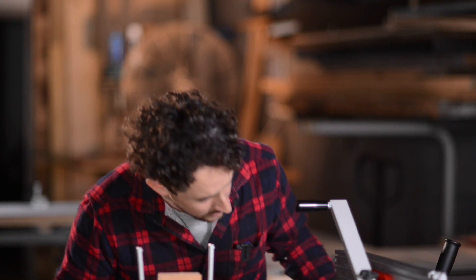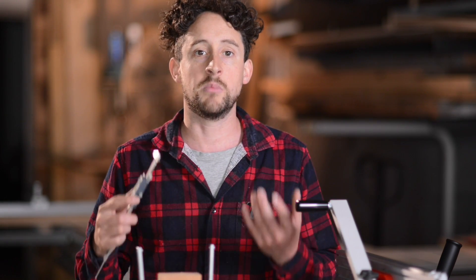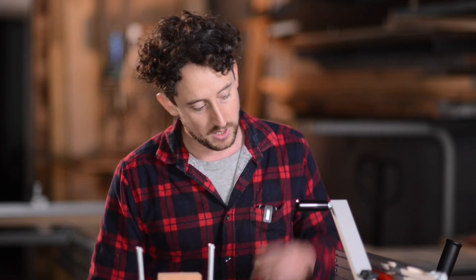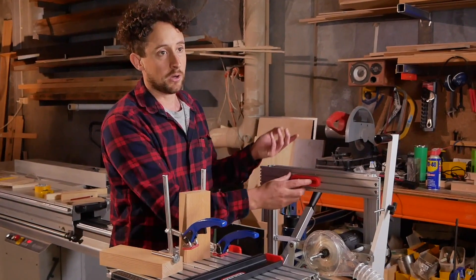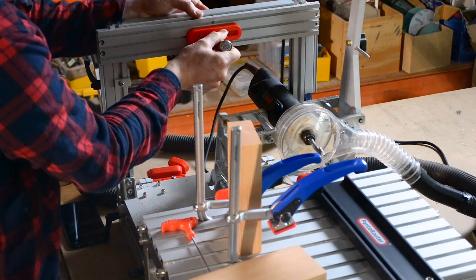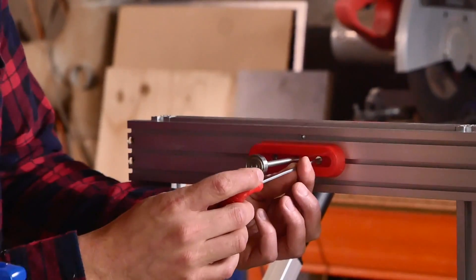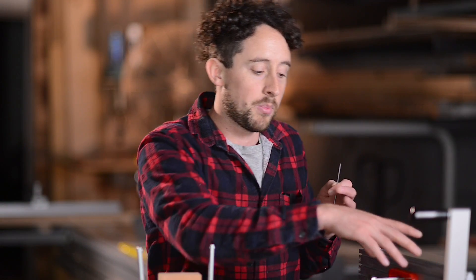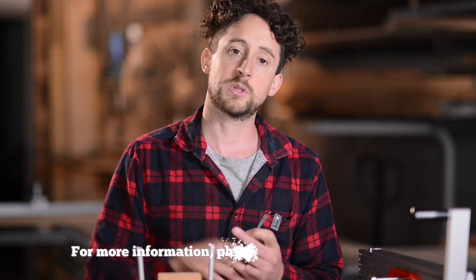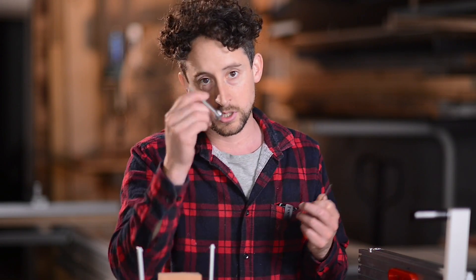The middle size C, which gives me a 45mm tenon, is the one I've chosen. On a 75mm piece that gives ample room on either side so I'm not weakening the joint too much. Once you've chosen your template, slide it onto the template holder and it's really important that you center it. Use one of the bearing shafts, place it through the center hole until it lines up with the hole in the template holder, then tighten up those little set screws.